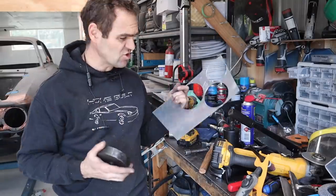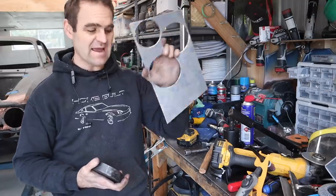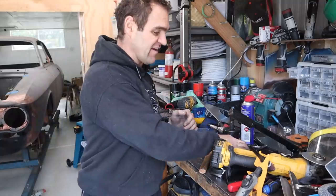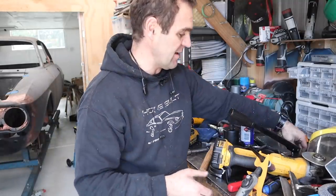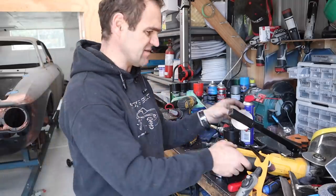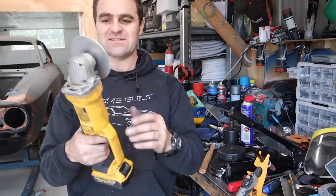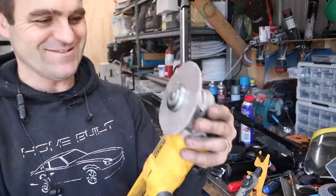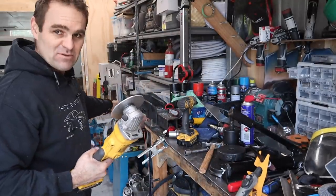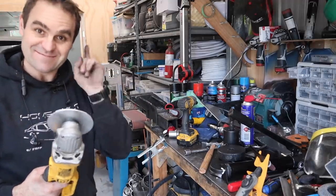This machine is quite a handy tool — it does very nice neat perfect circles out of the main piece. The circles you cut out have dimples in them that I've had to hammer flat, but after hammering them flat they've come out quite nice. The circle I've got is too big for what I need, but it's a perfect fit for my angle grinder, so I've put it on the angle grinder and I'm going to use the belt sander to turn this down to the size that I need.